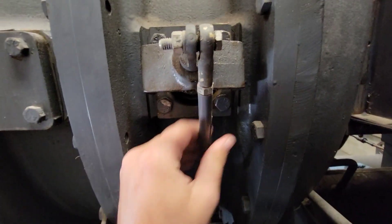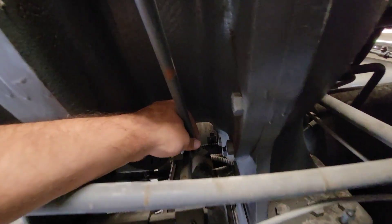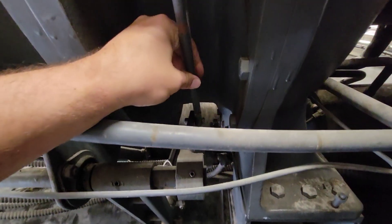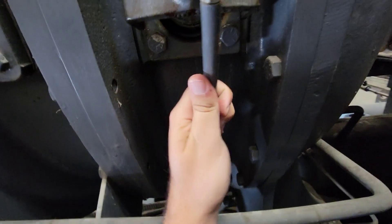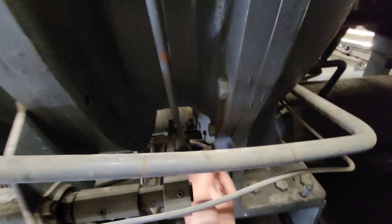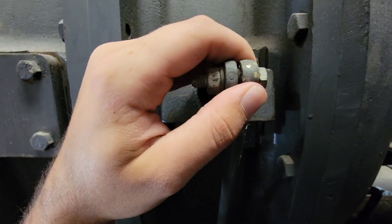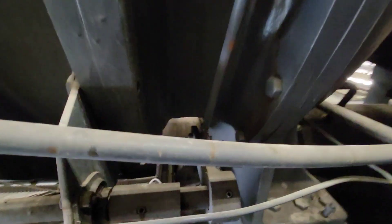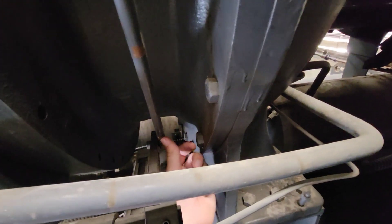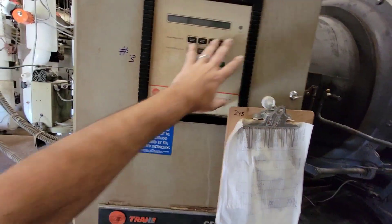Digging into this deeper - I'm checking this control arm, which is your second stage vane control. This tensioner nut down here has backed off and it's allowing some rotation, and we've got a little bit of wiggle. That is not good. I'm going to tighten that back down so it locks in and won't have that play. At the same time, this joint up here has just a slight wiggle to it. I'm not going to worry about that - this chiller is so old it's not worth trying to replace it and it's not having a major impact on operation - but I am going to go ahead and hit that tensioner nut so it doesn't give us trouble down the road.